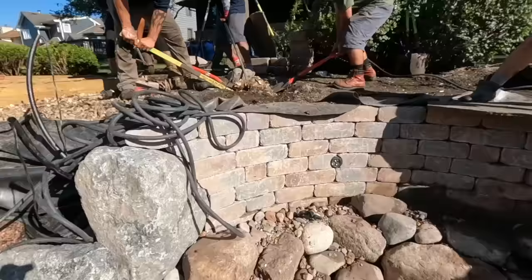Luis, Chris, and I also finished the patio coming down from their porch then walking over to their gazebo. Out of these pavers, we managed to get some really tight joints. One of the tricks of doing these pavers is using cardboard — with big pavers, it's hard to see what kind of shape or size you need. We pull each one up a little bit, shim cardboard under there, trace it out with a utility knife, exacto blade, or pencil, lift them back out, and grind it out. Then following that we step right over into our wetland — just a seamless transition.